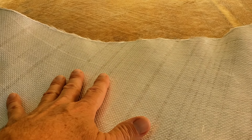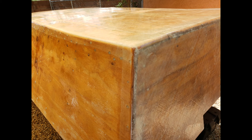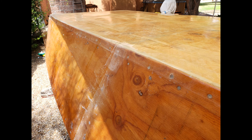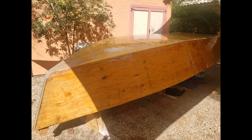I had limited experience with fiberglassing prior to this. The one thing I learned is to not leave mixed epoxy waiting too long in any container — pouring it out and spreading it gives you time to work with it. If left in a container, the heat reaction can be extreme. The glassing took several days. I used slow-drying epoxy for extra work time, but even so you have to let things cure before sanding and recoating. I also decided to add an additional layer of 6-ounce cloth to the bottom since I had enough materials left over.